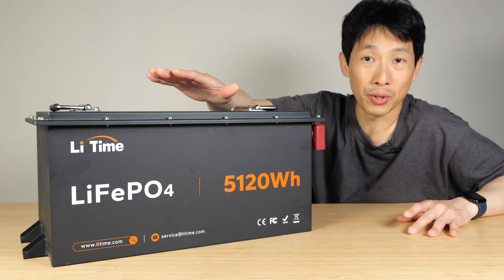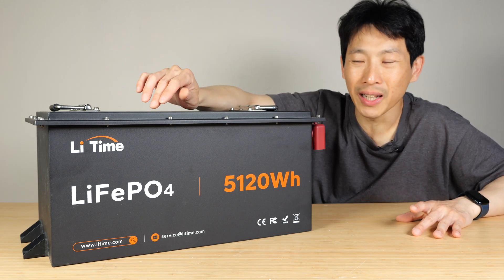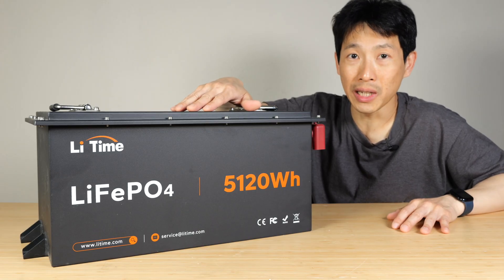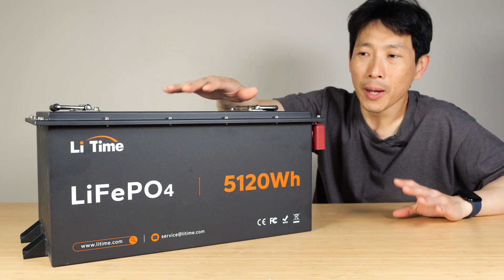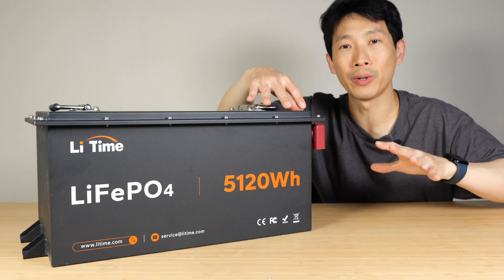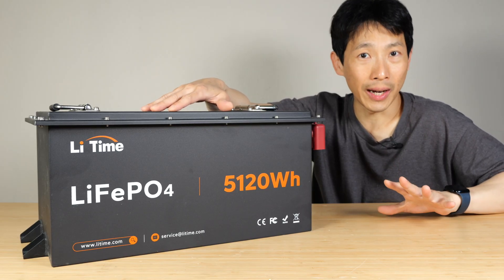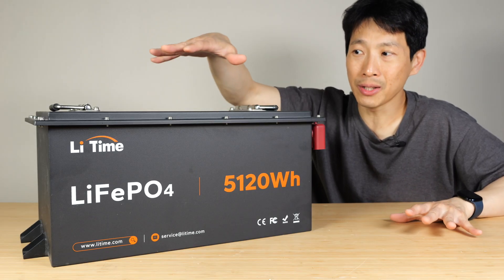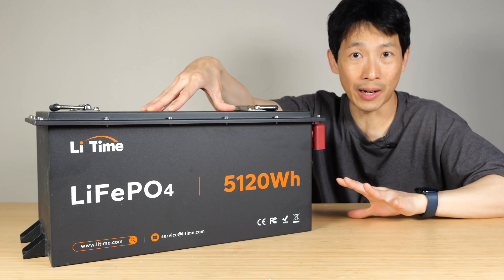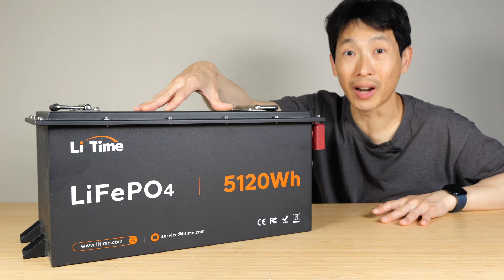Being a golf cart battery, you can do up to 600 amps surge. So if you're trying to get over a bump or something like that, it might take up to 600 amps — that is equivalent to 30 kilowatts. Although it's a 200 amp BMS, many times you can run these things over until the internal components are overheated. The design intention is that it can do 100 amps continuous, meaning you can run this thing at maximum, around 5 kilowatts, for an entire hour before it depletes from 100% to 0%. So a lot of energy in here.